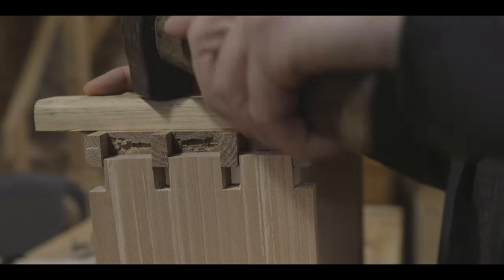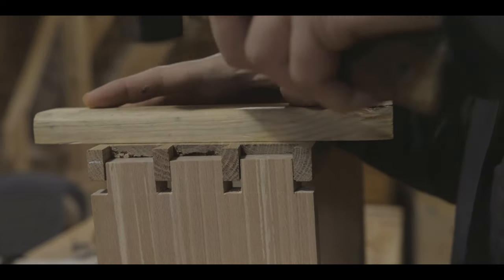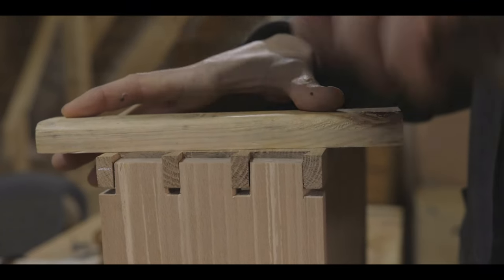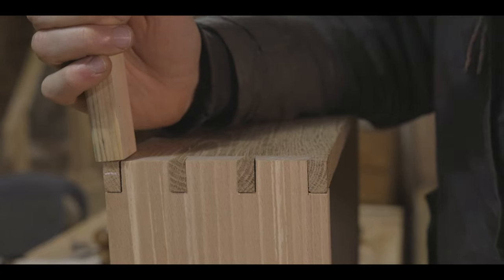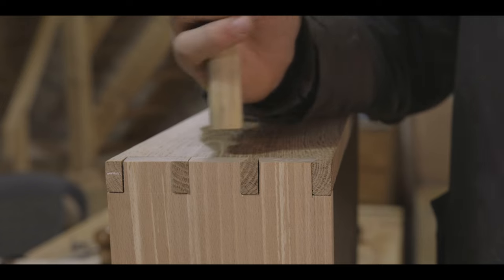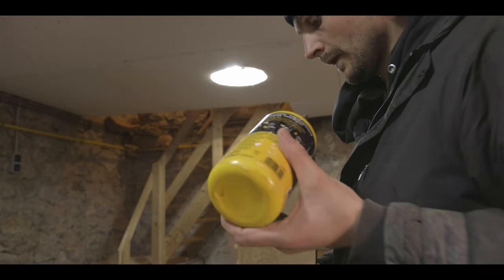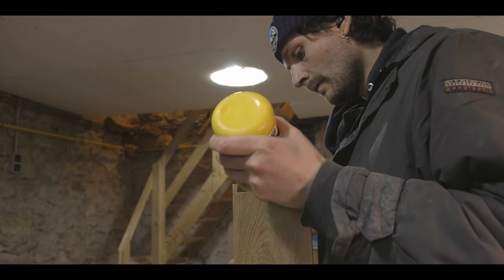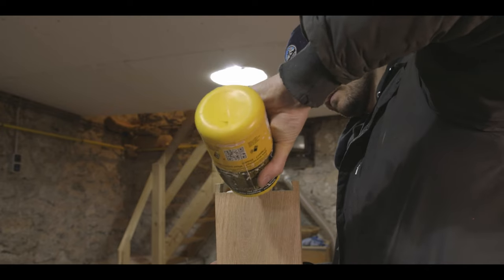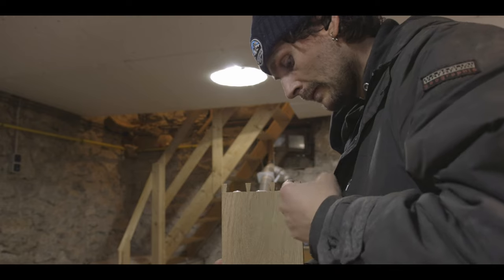When I was doing these dovetails, I was a bit more open on my cuts because I decided that I wanted to glue this piece. My previous piece doesn't use glue for the dovetails. But here, as it's a toolbox, I wasn't feeling fully confident on not using any glue. So the precision is not as good as the previous one. But that was actually intentional. I didn't want to be test fitting for hours every dovetail.